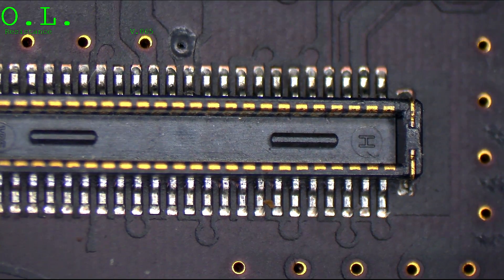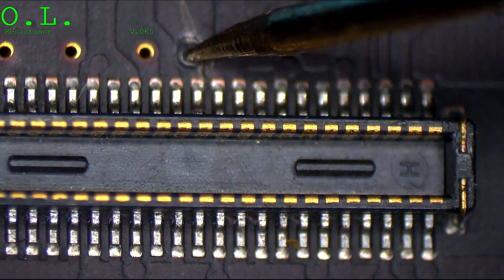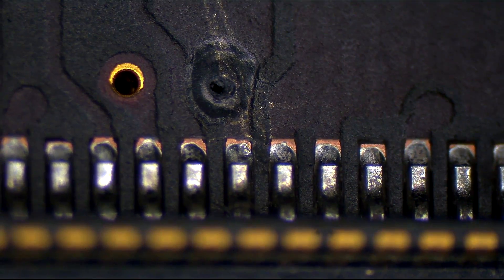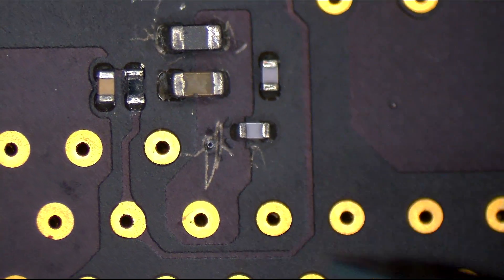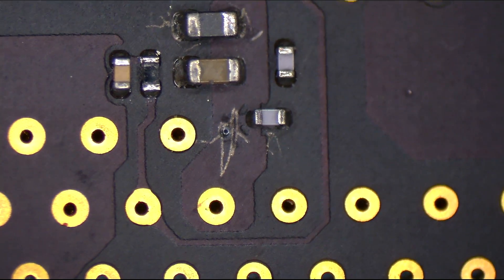As you can see, there's a little defect spot on the board right here — it's like a little hole but not a natural hole. These are the natural holes for things to be traveling from one side of the board to the other, but this just looks like a broken, pothole-looking spot. That's probably going to cause a breakdown. The only way to figure out what it is — there's not a lot on this line — is by knocking off the things that go to ground. The only things that go to ground on this line are these two capacitors. So I'm going to knock those two off and turn on my fume extractor before I do so.